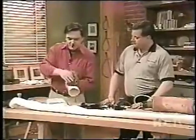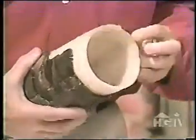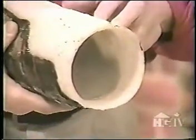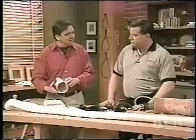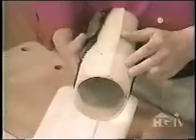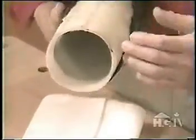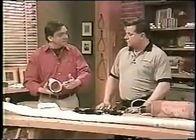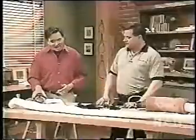Here's a crummy old pipe that was broken up and in real trouble. And here is a brand new plastic pipe on the inside that is seamless all the way out to the sewer — seamless out to the street. It can be put in lengths of up to 100 feet, which in most residential problems will solve the problem. And with no joints because it's seamless, the tree roots will never get back in again. They'll try, but they won't get back in. So it's a permanent solution.